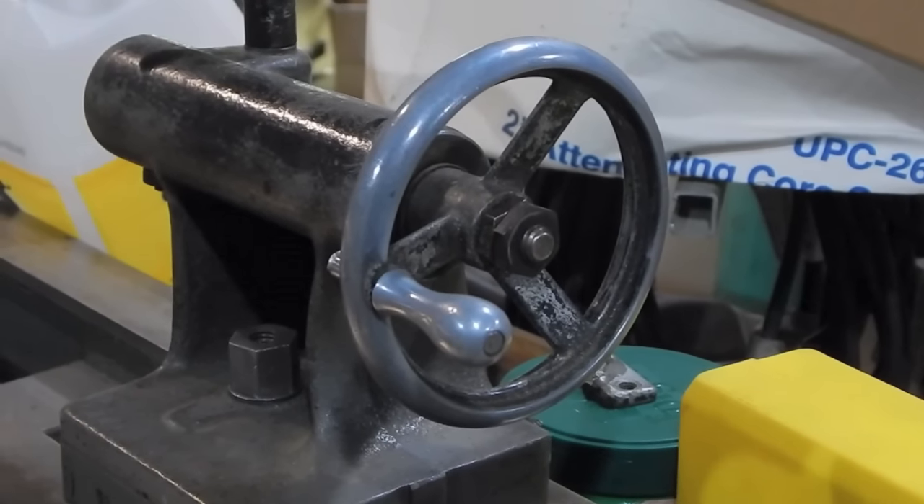I'm thinking ahead about what operations I want to do. This has got a sharp edge I don't like, so I'm going to want to knock that sharp edge off — but for right now I'm going to save that operation for near the end, because I like this nice crisp sharp edge if I want to use an edge finder on it. There's almost like a little bullseye right in the middle here, and I don't necessarily want to rely on that.